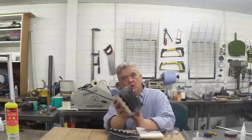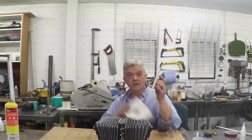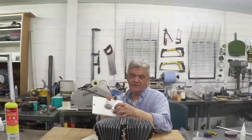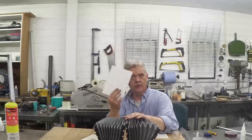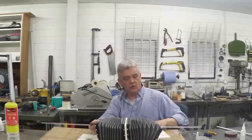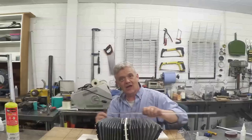So we have two sets of bellows, and you'll notice they're closed at one end and open at the other, and that's obviously to let the air in and out. These two bellows will be fixed to each other, and then what I've got is a couple of endplates with openings for them, so the endplates go on there. Those openings take a little air import, which is basically just a jar where I've drilled a hole in it. That jar fits in there, and we've got a little bit of pipe that fits in there - that's how we're going to make the connection to the air hose. Between these two we've got another board with two holes in it, and that will go directly in the middle. Those two holes are for rods, so the rods will go in as guide rods between the endplates, so those bellows will slide up and down, pushing those guide rods in and out as they move.